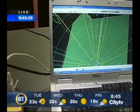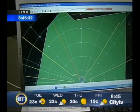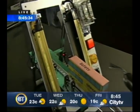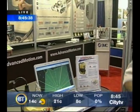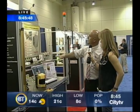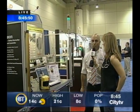Sometimes you could go through the area, and there'd be a green light, and that would say it's safe to go through that area. That's correct. That would be called muting in technical terms, and essentially what we want to do is get the rhythm between the worker and the machine happening such that there's a prescribed set of situations that we know someone's going to load a part into a dangerous area and then remove their hands, and in that case, from that moment, if you break the beam anywhere, you can see it indicates red.